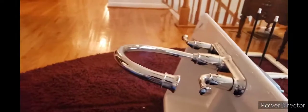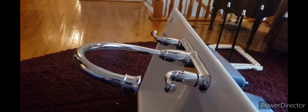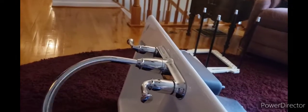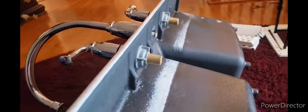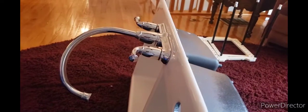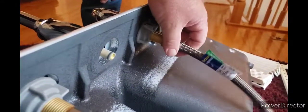Make sure those are tight — put a wrench on it. Another thing: make sure when you turn the handles on, they go in towards the faucet. You don't want to accidentally put it on backwards. Next thing up is the supply lines — tighten up those two gray nuts and then put the supply lines on.